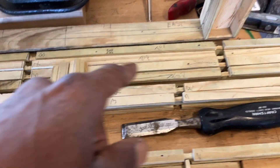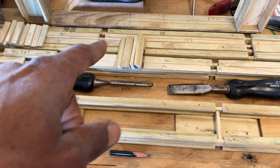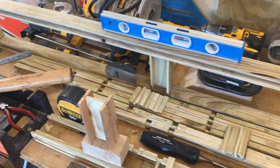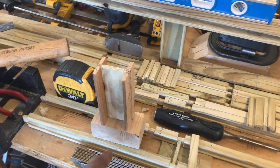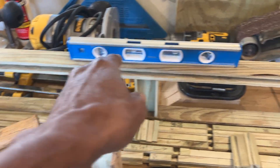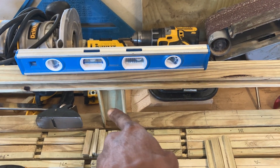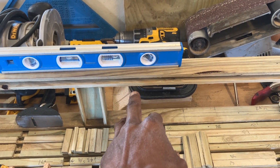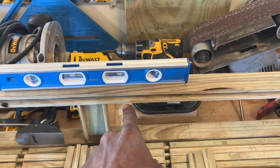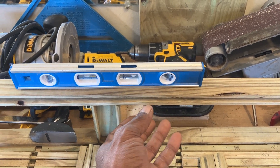All the information is on the actual boards. This is the back trestle right here — I might not put a column in the middle, I don't have to. This is pretty strong. It's quarter inch, quarter inch, and there's a quarter inch in there — this is a real I-beam effect for distributing the weight.